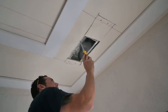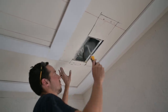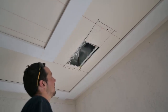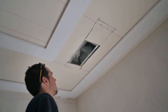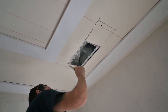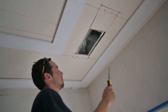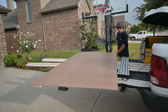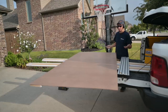This is good to go now. You can see there's a big gap right here — that's not going to be there when we wrap this with our tempered hardboard. We're going to cut out a hole closer to the size of the actual vent opening. This was cut wider so I could get the mounting system up in there and get it screwed in. We'll go back up in the attic, straighten that duct out so it has a good flow, and this part of the job is done. And in case you're wondering how tall I am — this is actually regulation height right here. I'm pretty tall.